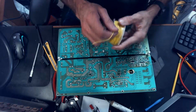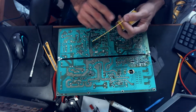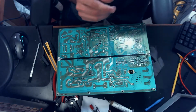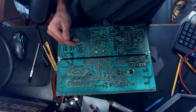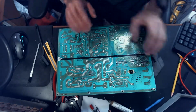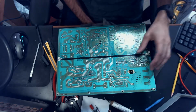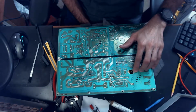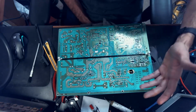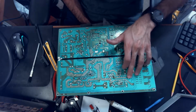It's kind of classified as a marine wire, but it's actually got tinning on it, and it can handle higher amperages than your normal 22 gauge wire. It's also stranded. It also solders really, really well, so it's a really good wire. And that Teflon coating is a really high heat resistant insulator, so I don't think we'll ever have to worry about this, as long as these other parts don't start cracking, which I don't think they will.